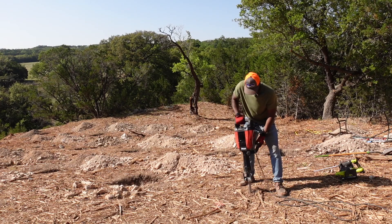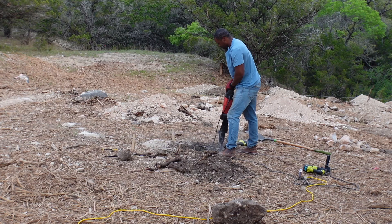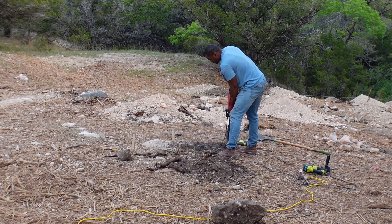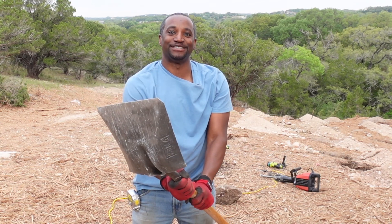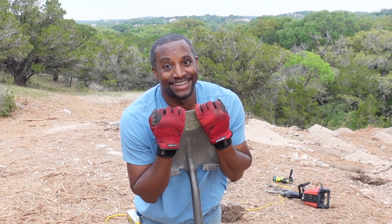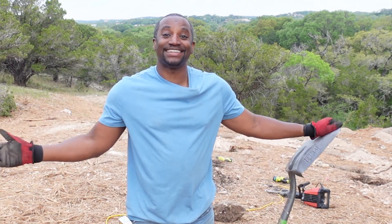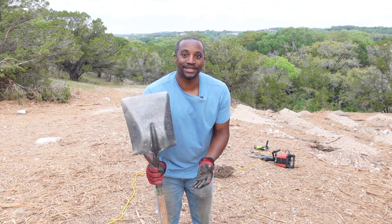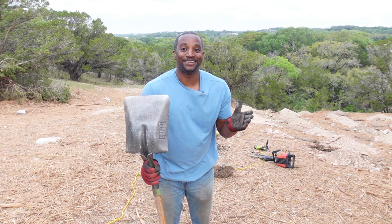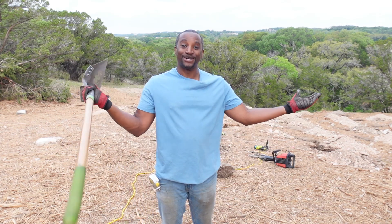And that was the mindset I used to finish the job of digging 20 individual footings down to 24 inches for the house, plus all the deck footings for the front and back decks. Victory! I did it! I dug out the foundation with a shovel, a jackhammer, and my hands — that's it. You guys have an idea of how much effort that took. That was physically exhausting, but I'm so glad that I did it. All I got to do now is come back with some rebar, some sonotube, some forms, and I can pour some concrete. And then I'm building something for real now.